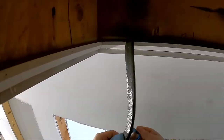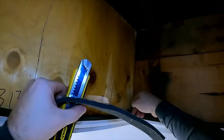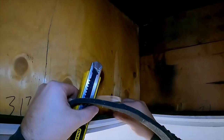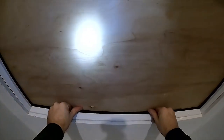You don't want to stretch this foam tape when you're installing it, and you don't want to try to turn corners with it either — just get it as far back into the corner as you can and then cut it. Now that you can see, you can see it compresses the foam just a little bit. Right in there you can see just a little bit of compression all the way around — and that is going to be a pretty solid attic hatch.